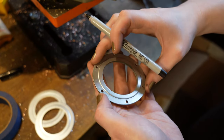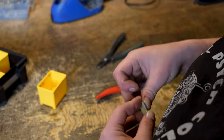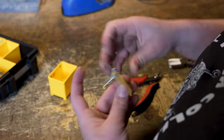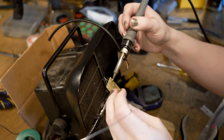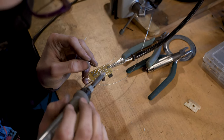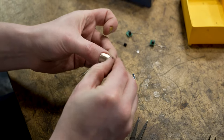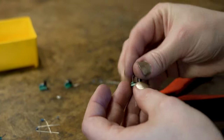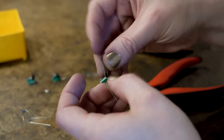With the body parts built, we turn to the electronics. Blank perforated circuit boards are populated with components, one at a time, stitch-wired together by hand, and then soldered up in the back. These form the body board — the electronics that will be installed in the base of the microphone. Similarly, the head boards, the electronics installed in the microphone head, are built by populating these tiny perforated boards with their components, most notably JFETs.